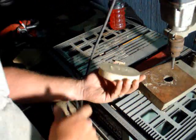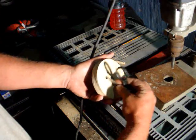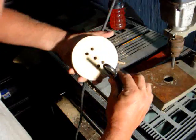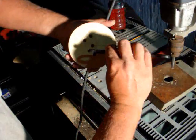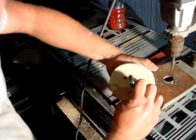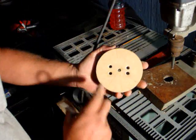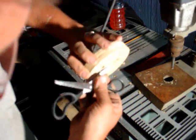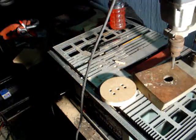Okay, and if you see on the edges here, you can see a little bit of shadow where the edges stick up. I stick the scissors in the hole, just go around one nice little circle — deburrs and cuts all of that off. Too simple. Don't have to change the chuck or nothing. Might as well do this one too — won't hurt the project. Now all of this will slap together and we're ready to wind some coils. Wee-haw!